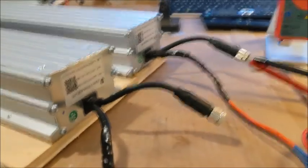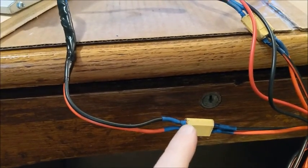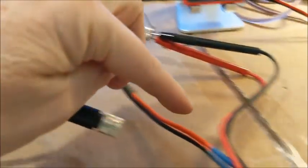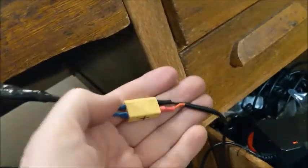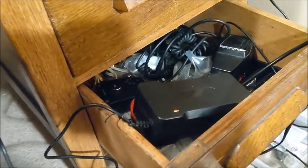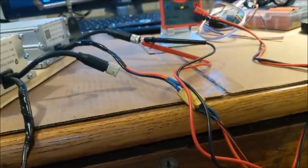Here's an update. On these two good packs I went ahead and cut off the small connector and spliced in an XT60, and did that to both of them. And sure enough, as soon as you plug it in and start charging it, it starts to show voltage. I also made up this pigtail — I'm not done with it yet but I've got two of the legs on it — going down to my 3 amp charger. So right now I'm charging these two at the same time. Ultimately I'll put XT60s on all of them and be able to charge all four at the same time.